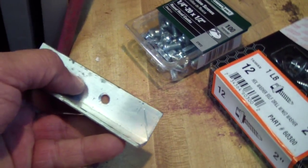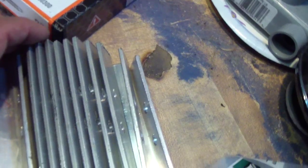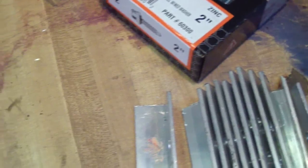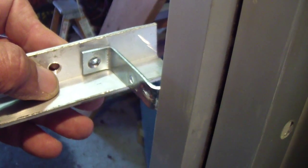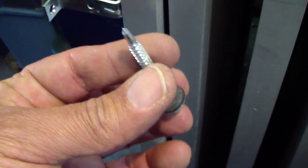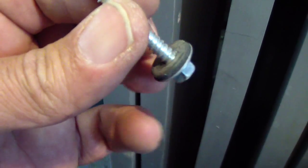These are quarter-inch holes, an inch apart — I made twelve of them for the five panels. This is how it's going to sit on the shingles: this one sits here, and this one is for the next panel. They're going to be connected and drilled to the roof by these bolts.